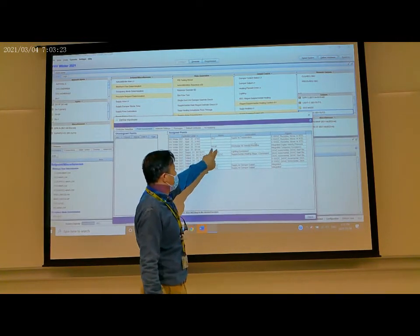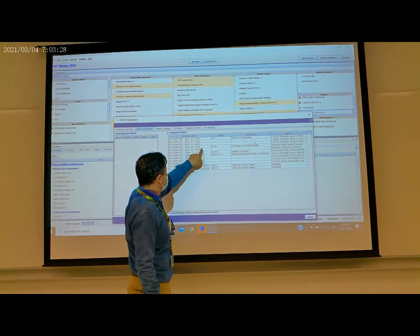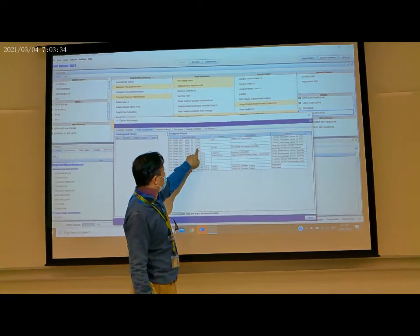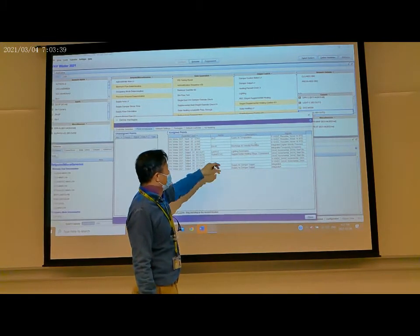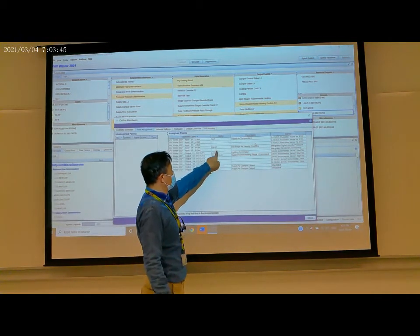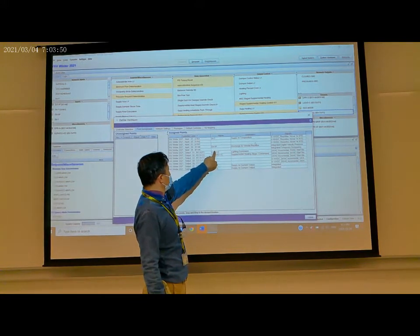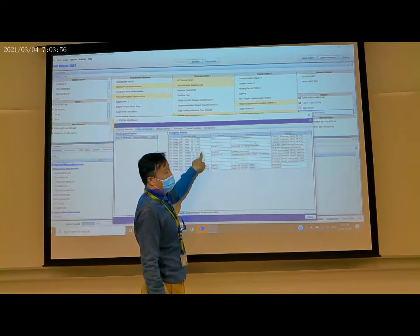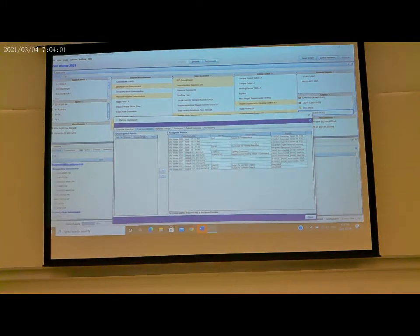And this discharge air velocity pressure sensor here is internal. You can see this is an analog input, input one, but it's an internal signal. And here, this is the lighting output. This is a lighting output. The output is a binary output. The output is one. Output one is here.